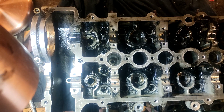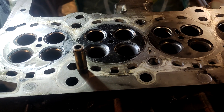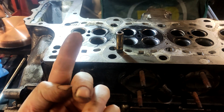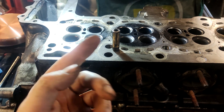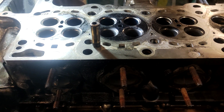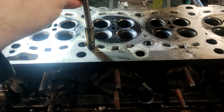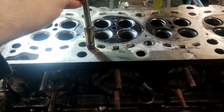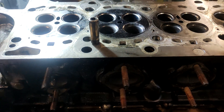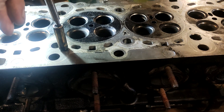I've finally got one out and checked the bore. From this side there's a lip at the end, so these sit in the lip. You need to be careful on the sizing of the tool you use to drive it out, because you don't want it too wide — otherwise it will hit the edges. This is what I used in the end to do the final driving.